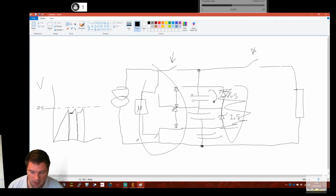That is the preferred method, but considerably more complex. Much more complex, and that's what the specific supercap chargers that you can buy will do. But of course, they're designed for commercial supercaps, a very different voltage window from what we're operating on. So we're going to have to think about that.